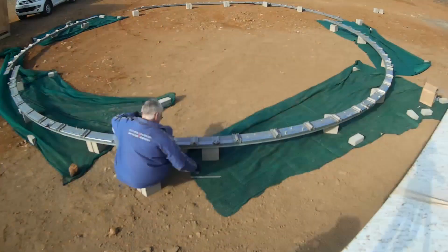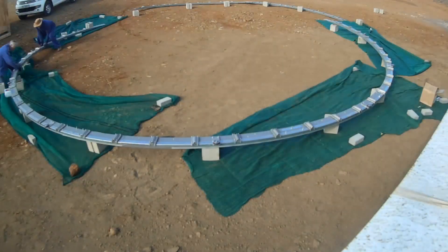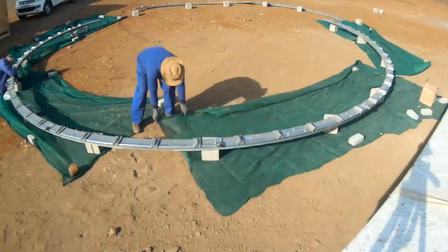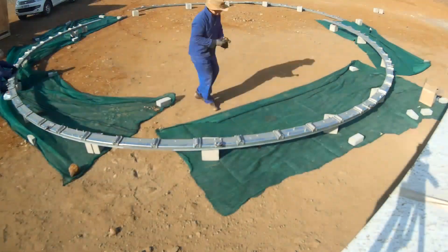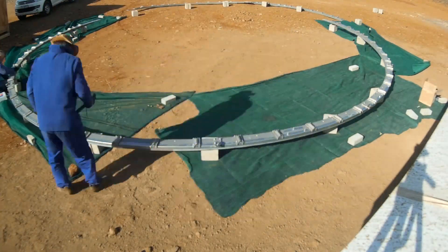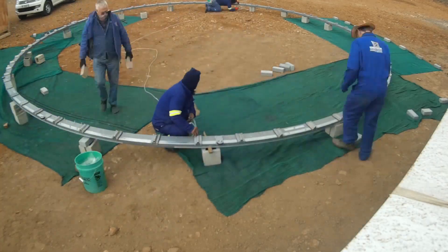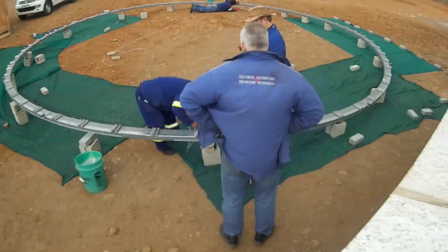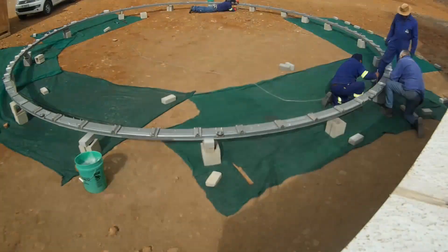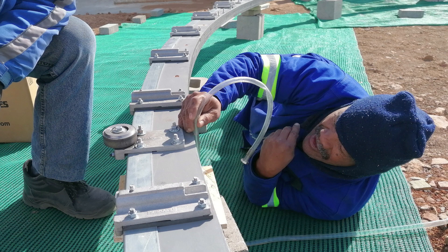While Hein and Abel were busy drilling, Hugo and I reassembled the ring on concrete blocks. To save us from having to work in the dirt, I brought four camping groundsheets which were nailed down to prevent them from being blown away. The size of the dome was again realized when they only covered about two thirds of the circumference. The ring then got leveled using a so-called pipe level — a very simple but effective method using only a transparent pipe partly filled with water.